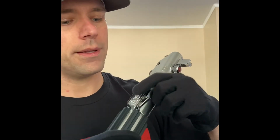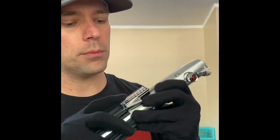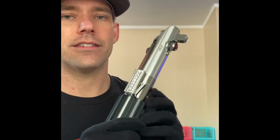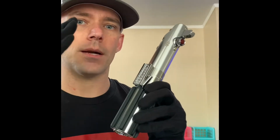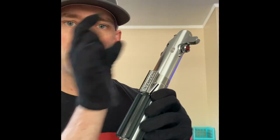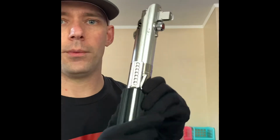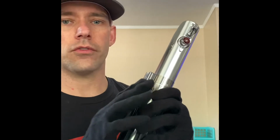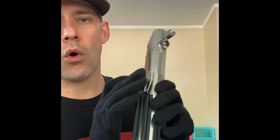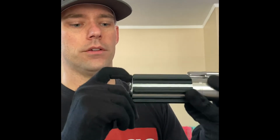It used to move up and down. Now there's a tactile switch, but it still moves around a little bit. There's a little bit of play in there because I had to sand it down to get it to function well with the tactile switch. So I sanded the bottom of it so that it could press down. And then I also had to sand the sides so that when this was clamped together, it didn't clamp that bubble strip so tight that it couldn't press down. So it moves freely, but the way it's made, it won't actually come out of that clamp. So it moves freely, but that's okay. It still works great.